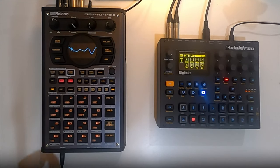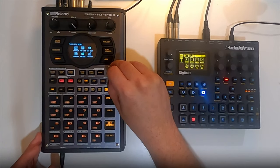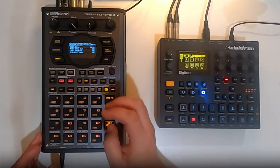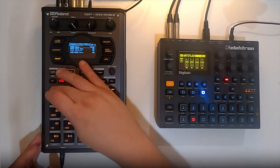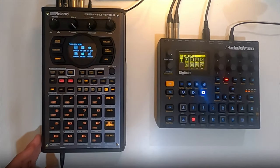So in the Mark II, your settings are in Shift-Pad 13. Then we go to MIDI settings. Here, basically, we're just leaving MIDI sync to auto, MIDI sync out on, soft through on, and MIDI USB through on. And basically, that's all we need to do in there. In the back of the unit, I have a MIDI cable going into the in of the SX using that smaller adapter.